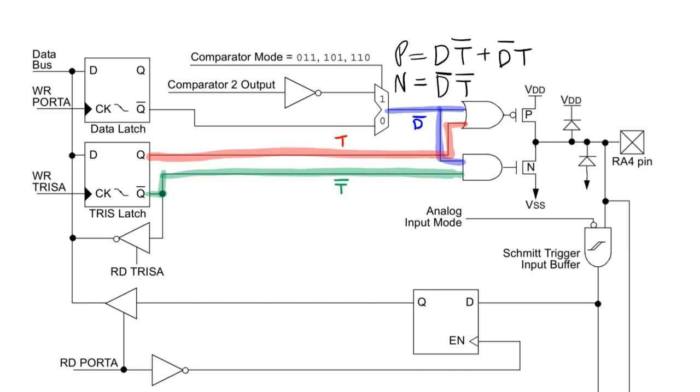But if you, for example, wanted to make it high impedance, you wanted to disconnect this output, this is a bit weird, isn't it? So what Microchip's doing is they're using an XOR gate and an AND gate to exploit a trait of these push-pull drivers: if they're not connected like this, then the outputs will be one of two things. They will be shorted, power to ground, or both of them will be open circuit, which is exactly what we want to happen. Because if this wire here isn't connected and this isn't connected, then we basically have it as high impedance.